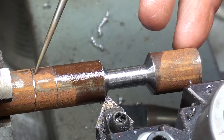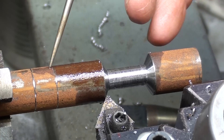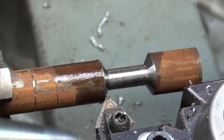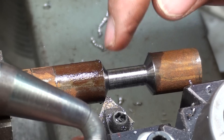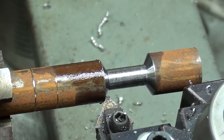I've marked it right here as 1-1/8ths from this shoulder here — disregard this other mark. Compound 7 degrees. And make sure you have enough travel with your compound. The idea here is we're going to try to turn a taper where the taper begins where the shoulder leaves off and ends here at my 1-1/8ths mark. Your compound has to be set pretty accurately, and that's the reason I made a prototype of this.